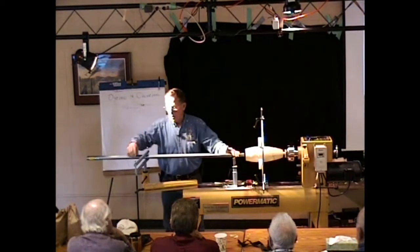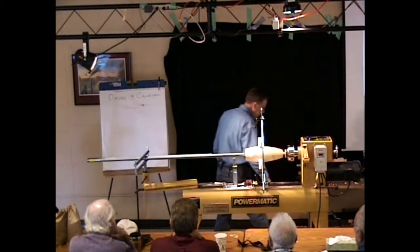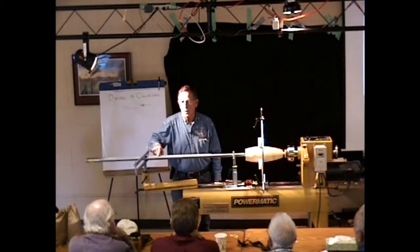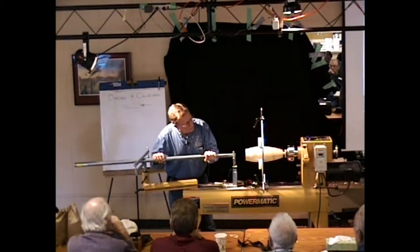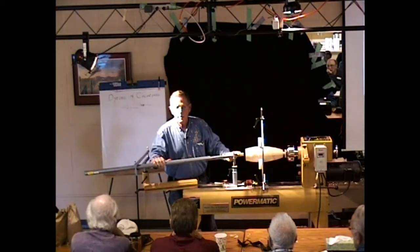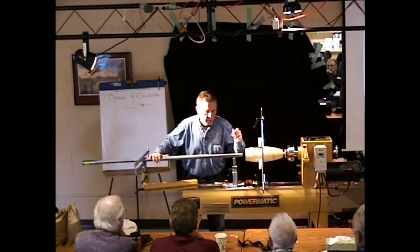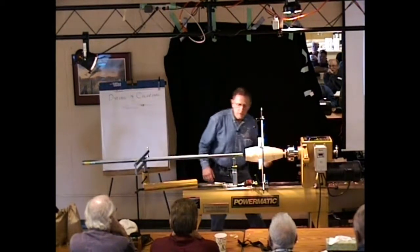I want to say a little bit about rollers. By the way, you saw this. There's one finger here, and let me put this down before I knock that off of there. I can take this one finger and I can move this bar anywhere I want with one finger. Why put a roller in there? Because if you have a roller in there and you want to do this and go straight in that way, that roller is going to be pulling that end of the bar over as it goes. And you're going to be fighting that all the time anyway. You're going to have to slide it on the roller. So we don't believe in using a roller. I could actually leave that in there now, I think.